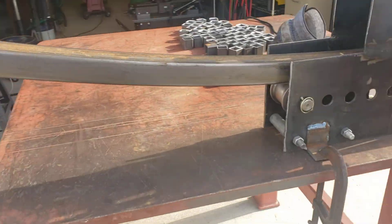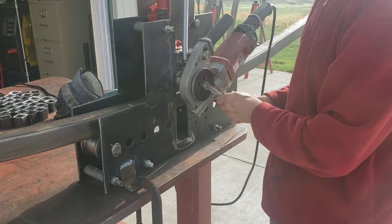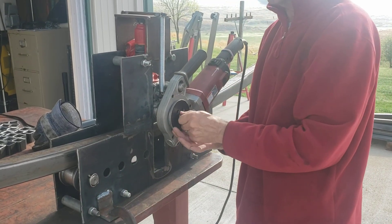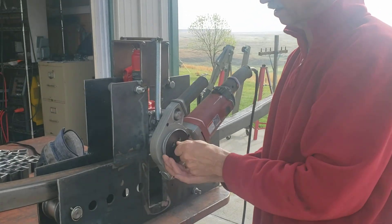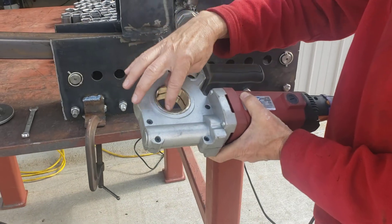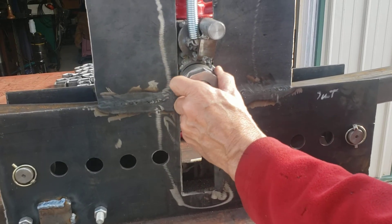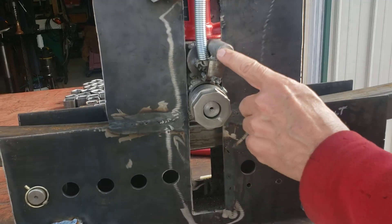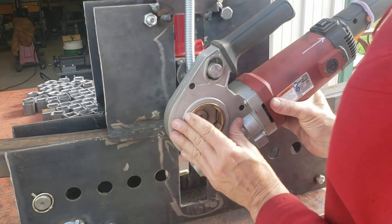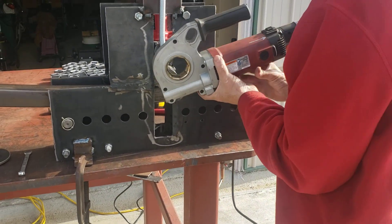Let me show you — I'm going to take this cover off. This gets pretty warm. I put four holes in that cover plate and it immensely helps the thing dissipate heat. The cover plate essentially holds the die roller on. Normally you'd put a die into that hexagonal thing and run it. But what we're using it for, I made this drive wheel on the lathe and on the milling machine. This little cog here just fits in to position it, and that plate holds it in. This is a worm gear — you get tremendous torque with this because it's a pipe threader.